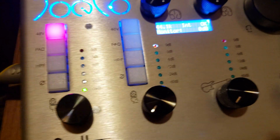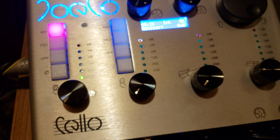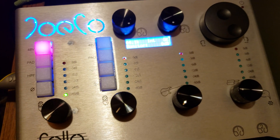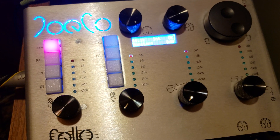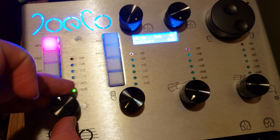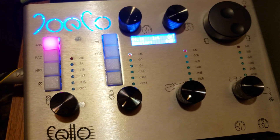You can see how the signal went up to about negative 12. If I had the gain higher, it would have possibly clipped the converter — I'm not sure if that actually matters, but anyway. After about 10 seconds, you should be able to set your gain to the proper levels. If you don't know what the proper recording levels are, I have a tutorial video for that.